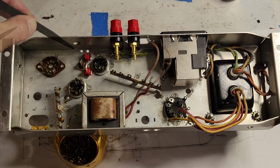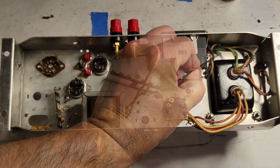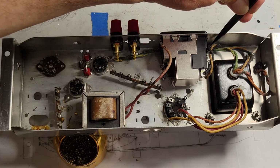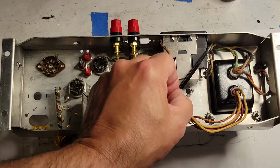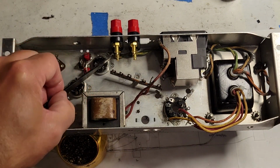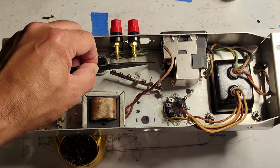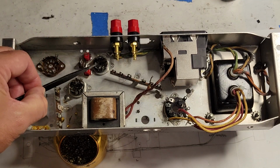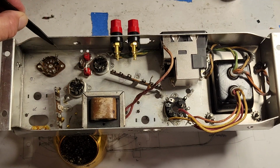The test point terminals. You can see here the holes for the trim pots. I've got the 6-volt heater supply going right over to the corner here. This is the sort of scheme that's recommended by Morgan Jones. If you've got a steel chassis, first of all, twist the heater supply wires together and put them in the corner of the chassis. And that provides some shielding. And so those go, in this case, underneath or from the top-down view on top of the power supply module, right along in that corner over to the first pentode here. And I'll run additional wires to the different tubes.